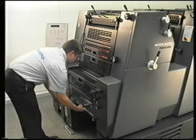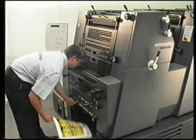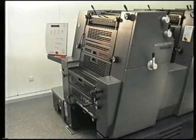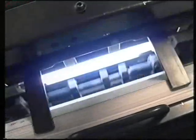This is done by printing 20 sheets a second time with the same setting. The print image of the middle 16 sheets must be accurate. This tells you that you have a good sheet-to-sheet register.